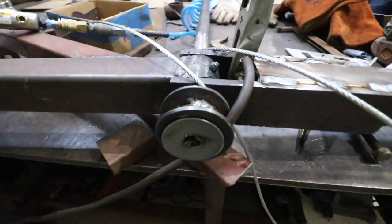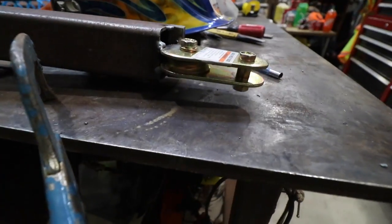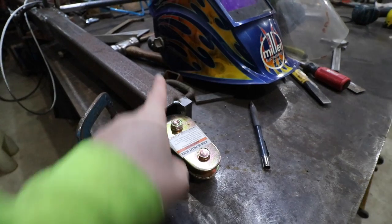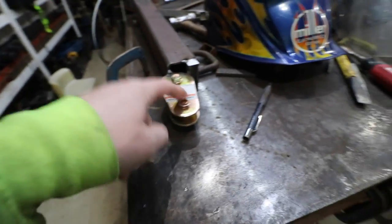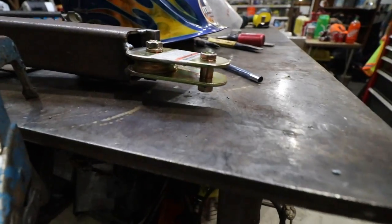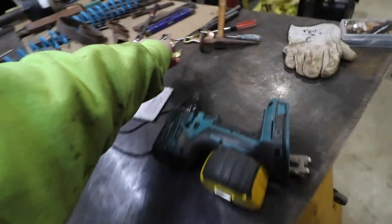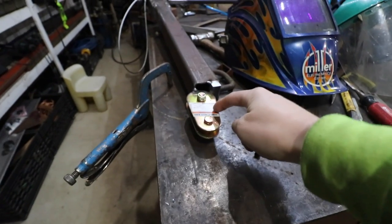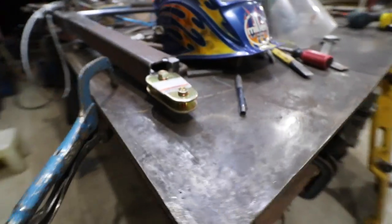Here's a wraparound pulley, and finally the hook pulley. Same idea — the force that's really going to be exerted on this pulley is in this direction, so we have a little block right here to prevent that from kicking out. The thing I like about using these Harbor Freight pulleys — these hooks used to be on here, but if you take them off and plan to do a little crane project like this, they're perfect because when you free spool the cable, you don't have to worry about the cable jumping off your pulley. These actually worked out quite perfectly for that application.